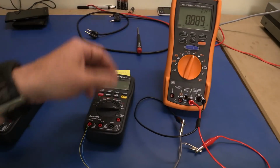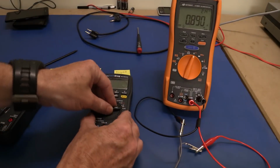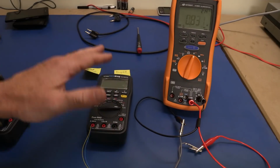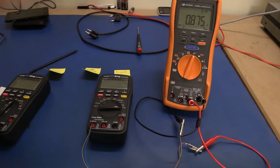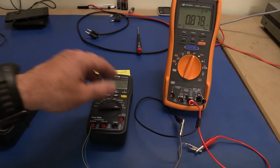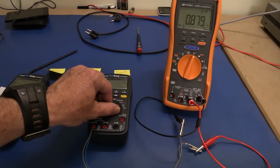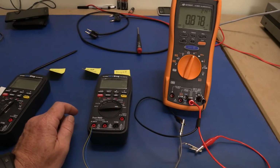Anyway, we've got our contact resistance here now, 0.9 ohms, and that's not varying at all. That's rock solid. So I expect that, of course, to increase. We're consistently getting under 0.9, and UEI have done some tests, and they're consistently getting under the 1 ohm mark.